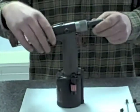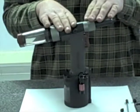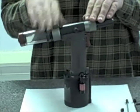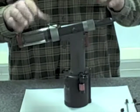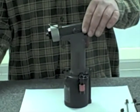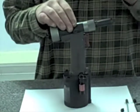The 2500 tool is designed so that you're able to do basic maintenance and cleaning of the jaws without any tools required. And actually, the changeover to different size rivets only requires a minimal amount of tool usage. First step of the process, I like to just pop off the mandrel collection canister and set that off to the side. It's really not needed for this stage of the process and it just gets in the way a little bit.